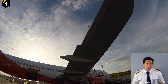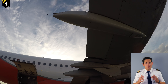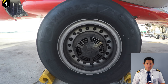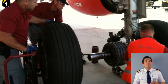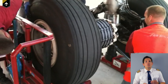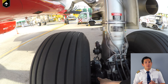The aileron should be hanging down as there shouldn't be any hydraulic pressure at this stage. Make sure that the flaps and control surfaces are in the correct position, and that none of the flap track fairings are damaged and are flushed with the lower surface of the wing. Now let's look at the right landing gear. Check that none of the wheel nuts are missing. Make sure there aren't any deep cuts on the sidewalls and check the overall wear of the tires — if so, call maintenance and they'll change a tire within minutes.